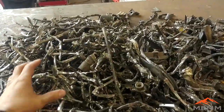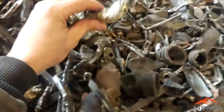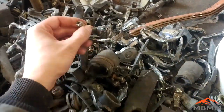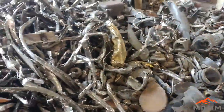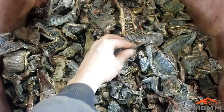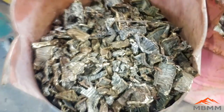Here's some of the stuff the magnet pulled out — you can see it's mostly these steel clips that hold the brass onto the plastic. But there are a few things like some brass with steel inside and little pieces with a steel nut on them, so there's some dirty brass in here I'll go through and pick for upgrading. Here are the two barrels full of clean brass that we got, hand-picked as it went under the mag belt. There are still some little rubber gaskets on there, but other than that it's all clean yellow brass.